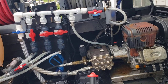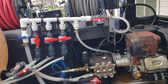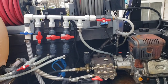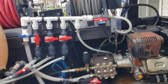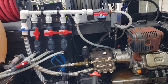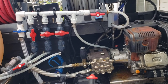Trying to wash a house and doing concrete with a little machine are two completely different animals. The little machine is going to be good if you're primarily a concrete guy doing sealer and everything like that — sure, you'll get away with a 2.5 GPM machine. But for house washing, it's all about the volume you can put out, your ability to rinse. The more volume you can put out makes an actual tangible difference in how long a house wash takes.